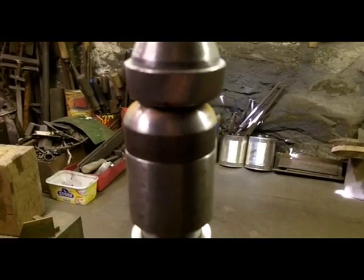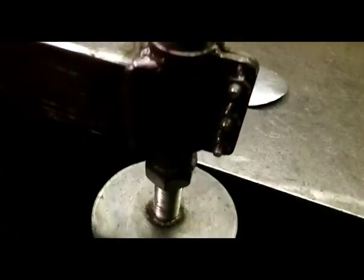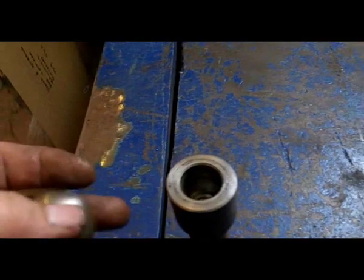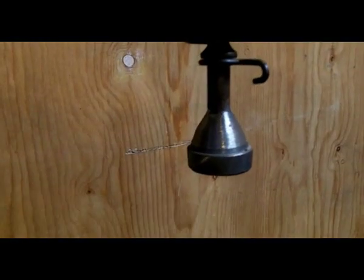We've shown you me making the hammer end up on it, but that was just turned sort of freehand in the lathe. Basically what that is, is a long sleeve that fits down inside, and I've machined a separate anvil which has been welded with hard face rods and similarly put onto the lathe and ground roughly to shape - so I can make up numerous ones of these as I go along. It simply fits into the top of here and then the whole thing fits into there. The bolts allow me to adjust this up and down so I've got a variable amount of movement in it, and we'll see how that works when I start using it.